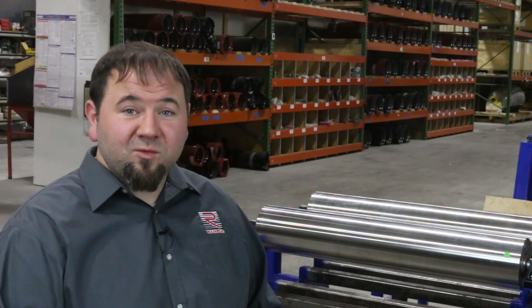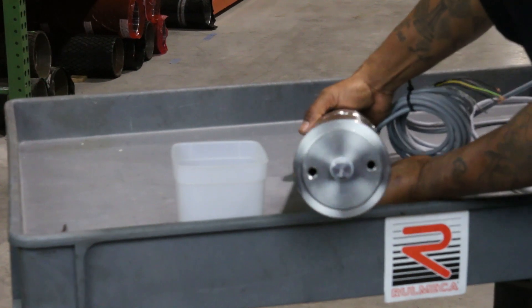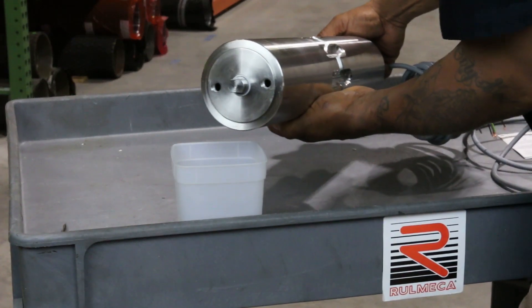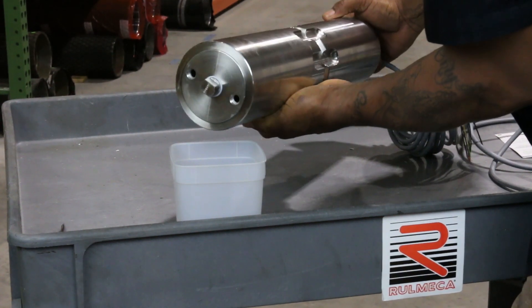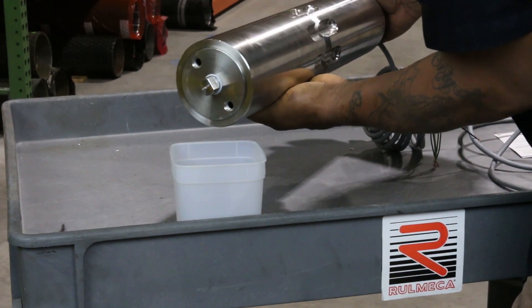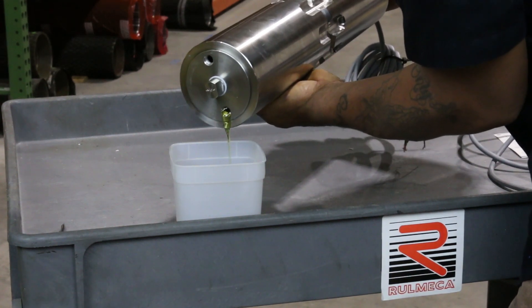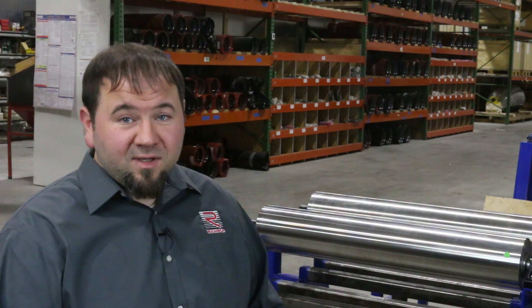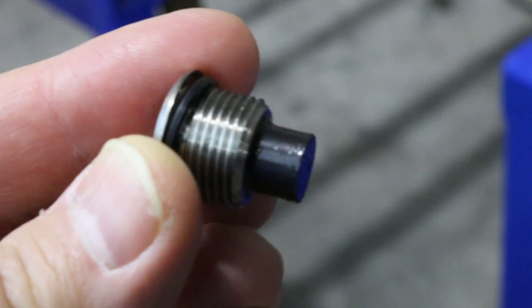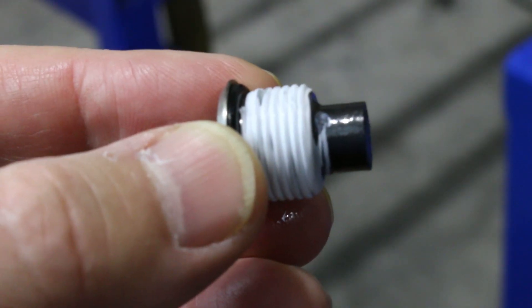To change the oil, simply rotate the pulley until the drain holes are at the 6 o'clock and 12 o'clock positions as shown here. Then place a bucket beneath the lower oil plug and remove both oil plugs to allow the pulley to drain and vent. It may be necessary to tilt the opposite end to completely drain. To refill the oil, replace the lower oil plug after wiping off any sludge and residue from the oil plug magnet and wrapping the threads with Teflon tape.